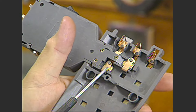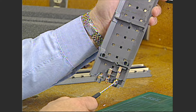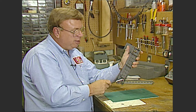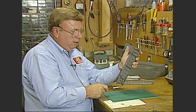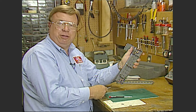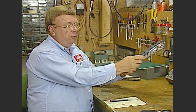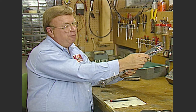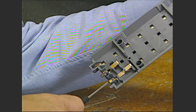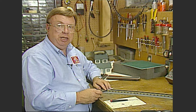Note that it only picks up one outside rail and one center rail. It does not pick up the opposite outside rail. The other opposite rail can be picked up by plugging another contactor in on this side if you wanted. So what you can do is make an insulated outside rail anywhere you want with MTH track by simply intentionally collapsing this contactor so that you don't allow it to touch the next contactor. You can make an insulated outside rail as long as you want by using as many pieces of track as you need. We've bent the contactor back so that it won't make any electrical connection on this end, but allowed it to connect here, and on this other end we've bent it back. So that'll give us a long insulated rail over as many pieces of track as you need to accomplish the purpose.